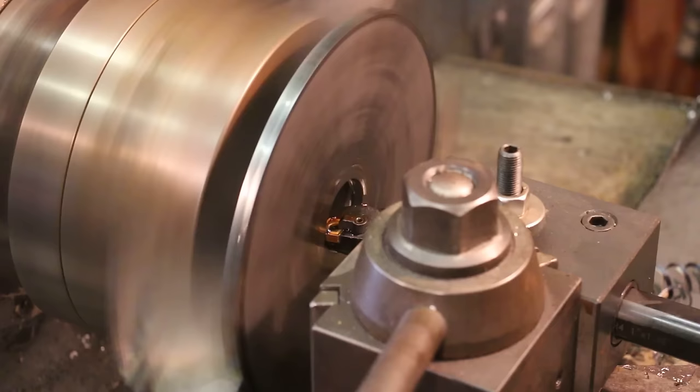You know, this is one of those jobs that if I had to do it again, instead of trying to use a piece of blank material that I basically got for free, I might have just gone ahead and paid a little bit extra money and had somebody burn these out, where I didn't have to drill the hole and I just had to bore the hole out, and where the outside diameter didn't have so much material to cut off. It was quite a tedious job on the lathe. It wasn't hard work, it just took a while and we could have sped that up considerably. And for no more than it probably would have cost to get these burnt out, that probably would have been the way to go about it. But the way I did it worked, and hey, I used free material, even better.